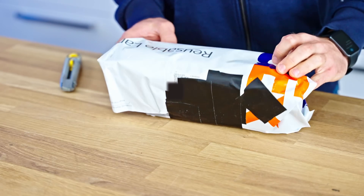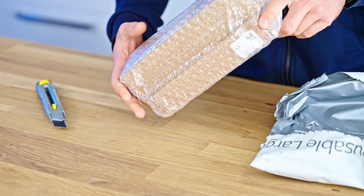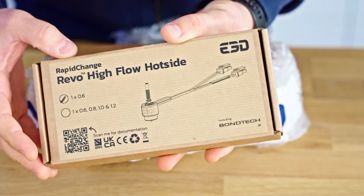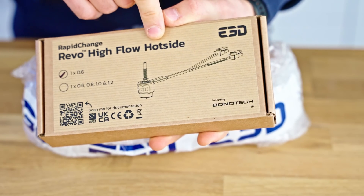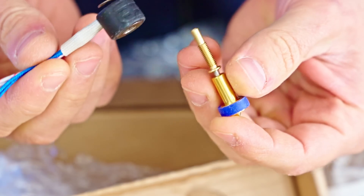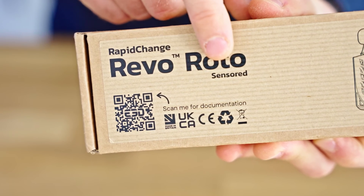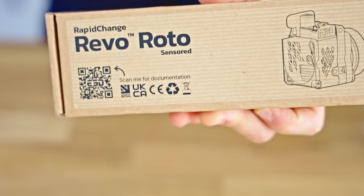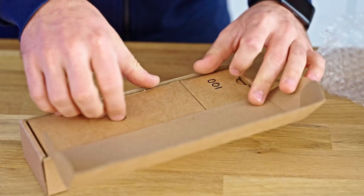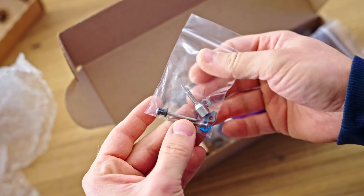FedEx, what did you bring us today? They've also shipped me a high-flow Revo hot side, which is nice of them. That includes a 0.6mm high-flow nozzle and a high-power heater cartridge, but we're gonna stick with the standard power heater for this one. And this is the sensored version — so it's the same Revo Roto, but with a whole bunch of sensors tagged onto it that you can use to measure stuff about your extruder and hotend.